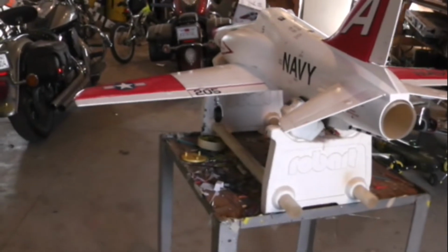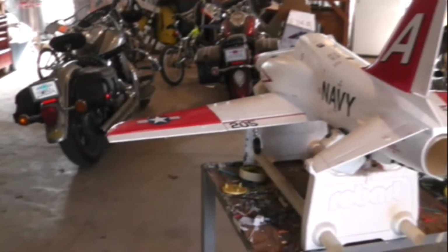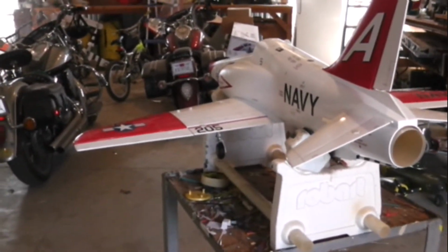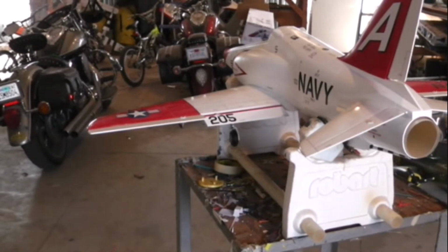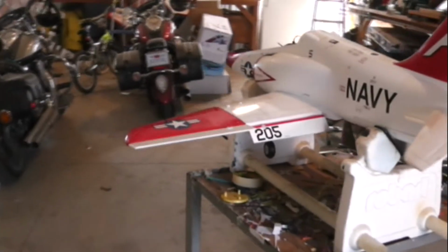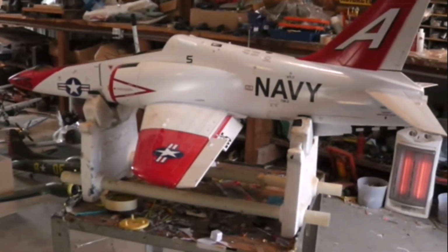And as we come around to the back of the plane, we're doing some unusual mixing here. This is called reflex. When the flaps go down, you'll notice the ailerons go up slightly to assist with the slowing down of the plane. So this is reflex 1, and that would be a typical approach, and then the landing approach. You can see the flaps deploy. Here's a side view. Okay, flaps going back.